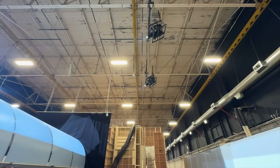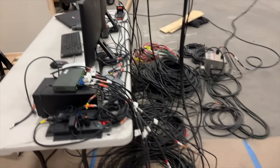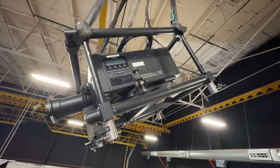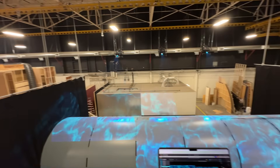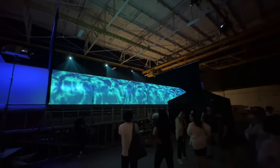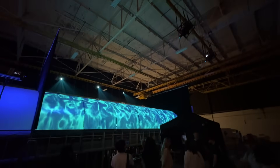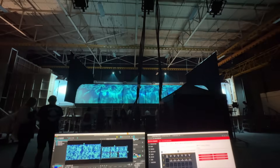There were plenty of different ways to hang the projectors, both for the testing and for the temporary installation, but I didn't get to make any of those decisions on this one — that came from higher up the food chain. We could have hung some motors from the ceiling, spanned some truss from the motors, attached the projectors, and lifted everything up that way on both sides. Instead, they decided to sit the trussing on top of the beams in the ceiling and drop long verlock cable down from that trussing to the four corners of the projectors to nail the exact angle we wanted, because verlock is pretty easy to adjust and very strong. Having four points of contact also acted like a safety for each other, because if one or two failed, the other two cables would still hold up the projector. I didn't hate the idea, but if we did it again, I would go with chain motors for a quick up-and-down configuration — though there are pros and cons to both solutions, to be fair.